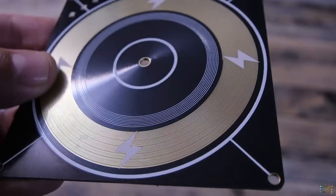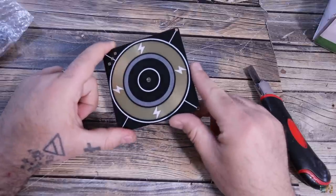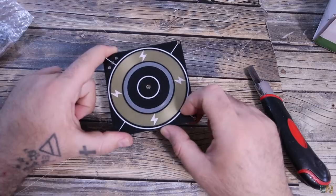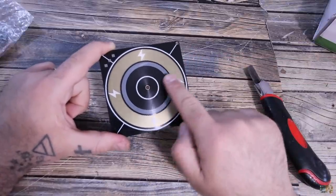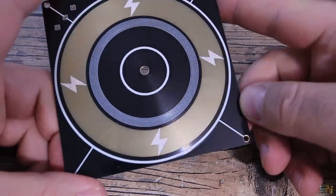So I'll just make a zoom in, and you will see that these are just very fine tracks. And I've especially designed this and talked with the PCBWay engineers to make this 0.15 millimeter width, and also gold plated, so it will have a lot lower resistance. And I think I have here like 200 and something loops. Okay, so I've made a zoom in. Actually, I'll try to place on your screen some close up with the macro lenses, but as you can see, we have some very fine tracks.